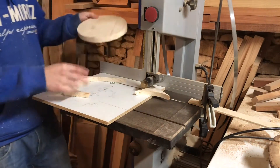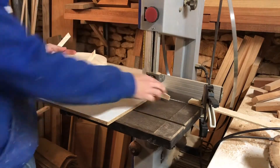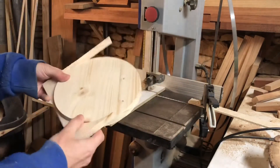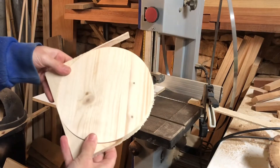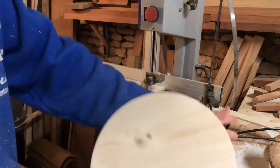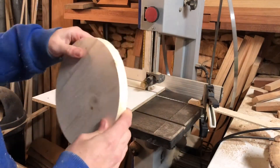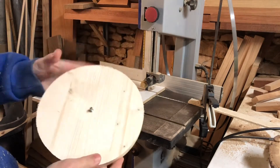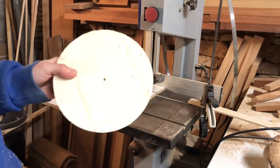And there you have it — it is that simple. As you can see, it gives you a really nice neat cut, a really good circle. As long as the blade is set up steady between the clamps and can't move anywhere, you turn it round and you end up with a perfect circle. You've got the hole on one side so you don't have to go all the way through.